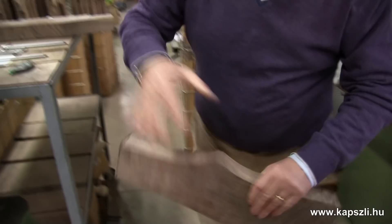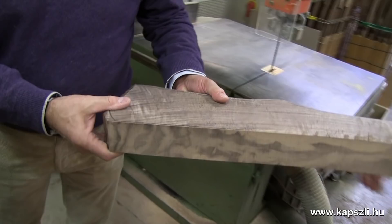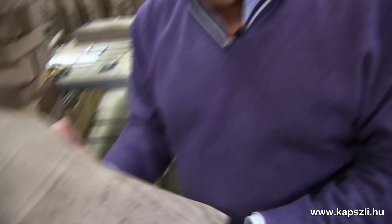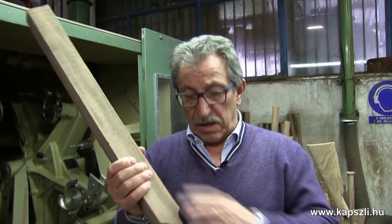We need the luxury wood for very nice guns, like Extra Deluxe Sharps with golden inlay. The wax is applied to the ends to avoid air going inside and breaking the wood. Then we go to the turning — the wood coming here. You can see it's a different pattern. We put four blanks together and we are going to turn them. This is the first and second stage.